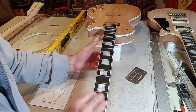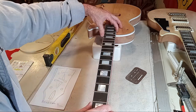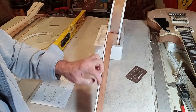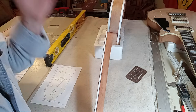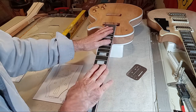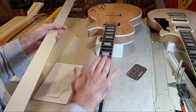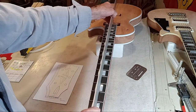And I'm going to try to stop reintroducing how to rebuild the wheel, how to redesign the wheel. But in other words, you wouldn't have wanted to do the binding at that point because you run the risk of not having a really beautiful, clean, truly finished bottom line edge, because it might have just got off a little bit. But the primary reason you want to epoxy the fretboard down is because by using that 2 foot level, it put the fretboard and the fret plane back in a perfectly straight plane.